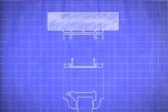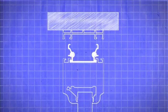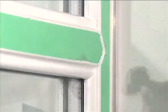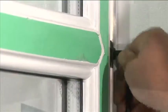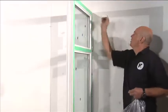Select the A129 wall plate adapter and 2 A128 wall plate connectors. Slide the adapter and connector downwards so it's held by the window's inner legs until it rests onto the sill. Slide the window and connectors along the sill to engage the legs of the connectors with the legs of the wall plate. Quarter turn buttons should now be positioned between the panel and the wall connector, around 50 mm from the top and bottom.